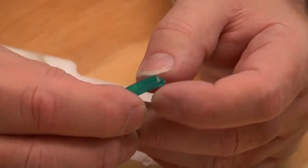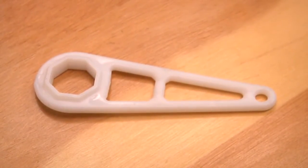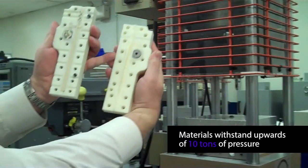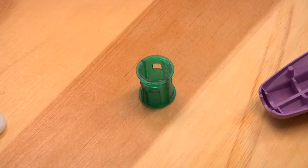The customer doesn't have to make concessions in their design, doesn't have to cut corners, doesn't have to wonder if it would have worked another way. They didn't have to modify the part. These printed molds, we clamp with about four to five tons of pressure so they don't flash. We don't have to trim parts when we're done — we pull them out of the mold and ship them.